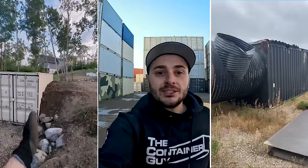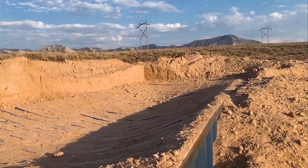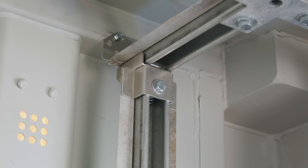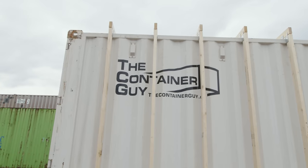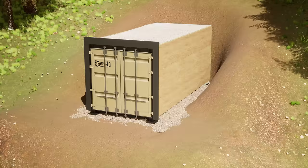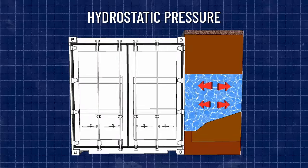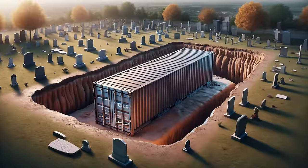Future Channing here. Before we show you our system, so many people have tried this and failed. You can't just go and buy a container, bury it, and expect it to work — it will fail. You need to both structurally reinforce the interior and the exterior. If either one is able to support the earth on top, then if one system fails you're still safe. Another thing is waterproofing — you're going to want a full waterproof membrane around this thing. As Ron says, hydrostatic pressure never sleeps, so you won't get any premature corrosion causing catastrophic failure.